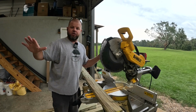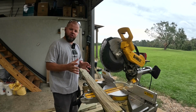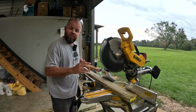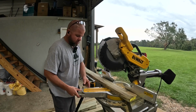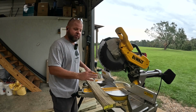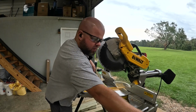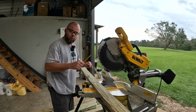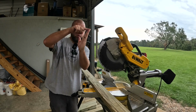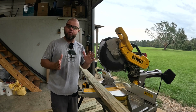Okay, once again, because we're making such a long picnic table, we need to do some extra bracing in the middle of the table, or otherwise we're going to experience some sag. So the last thing that we're going to cut is some bracing that's going to go from the legs itself to support the center of the table. These need to be at a 20-degree angle, and the angles will be cut both the same direction, and we're going to cut these 41.5 inches. So let's go ahead and get our first 20-degree cut. Measure down 41.5. And that 41.5, all these measurements I'm giving you, no matter how the angles are, that's overall. So don't measure from one tip here to 41.5 here, because whenever you make your long cut this direction, you're going to be even longer. So this is overall measurements that I'm giving you.